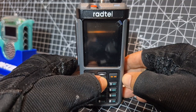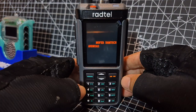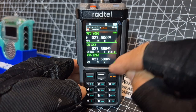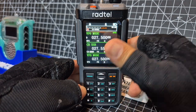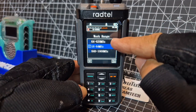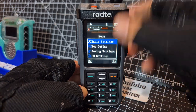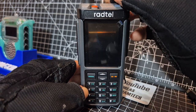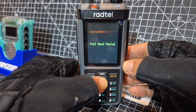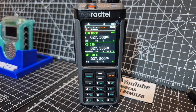To get into full band mode, turn it off, hold down the down arrow, and turn on. To go back to normal mode where you select which mode, keep your finger on it. We're using CB mode at the moment. You can set a shortcut button to change modes — you've got parameters 66 to 620. It does affect your scanning. Turn on, hold the down arrow, and you can start to mix and match again. Hope this helps — bye for now!